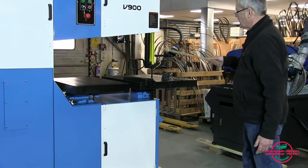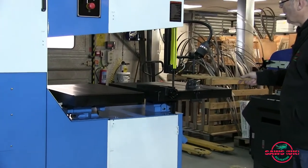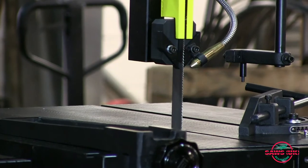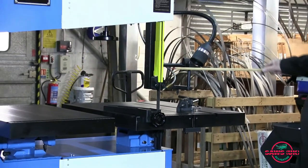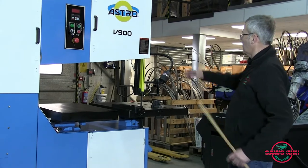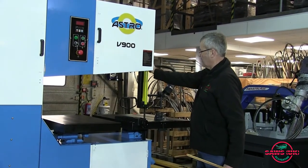The blade guide is guided with carbide tips here. There are chevron guides so they can be adjusted. There are carbide-tipped guides here and here for that purpose. Fully adjustable with a carbide backup guide, so you should not have to do any maintenance on this machine for a long time. Obviously parts are available. The guide moves up and down with a wheel here and can be locked up here.